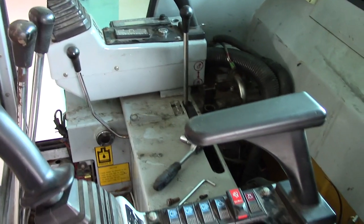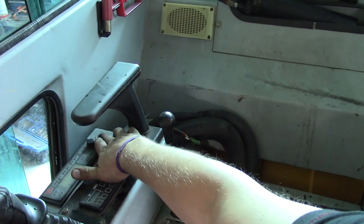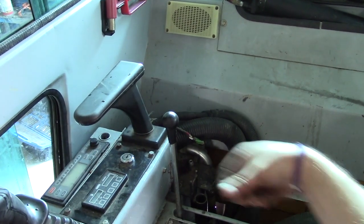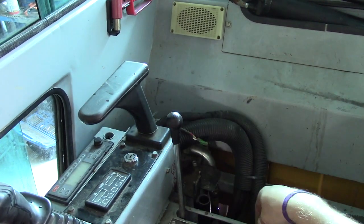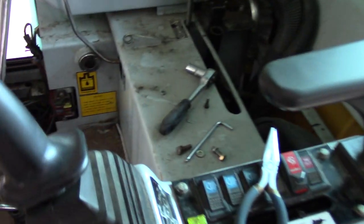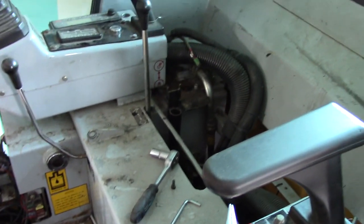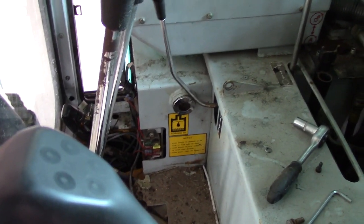And this other end there, I think I found the issue now. I was looking around a little bit. In this end here is a lighter, or a cigarette lighter. That one had inside of it several bolts. So some kid most likely put them in there, or someone else, and that shorted everything out. And then the next guy that rented it most likely put in a 40 amp fuse or something, I don't know, and perhaps didn't remove it. I removed the cables here now, so this won't happen, and we'll be taping them.